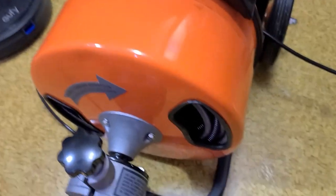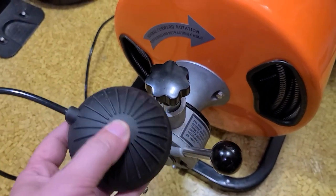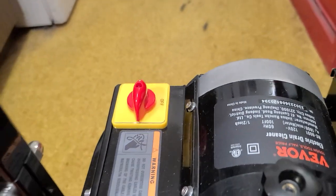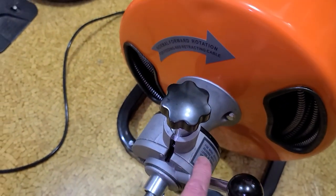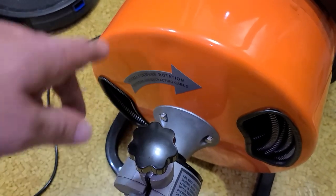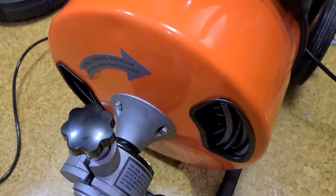Other things are more proper. The feed head seems nice. It does use a pneumatic switch instead of actual wire cable — this is just a little air bladder that connects to a switch in the control box. It is reversible, although you always run these in the forward direction and use the feed head to run in and out. But if the cable gets totally jammed, you can run it backwards, though that can cause twisting inside the drum. That's why they have an arrow, and why you're always supposed to run them in the forward direction.